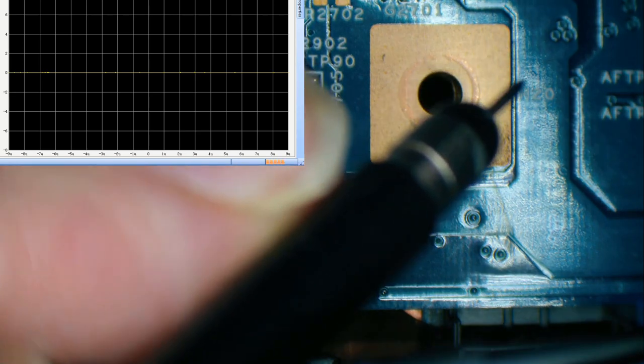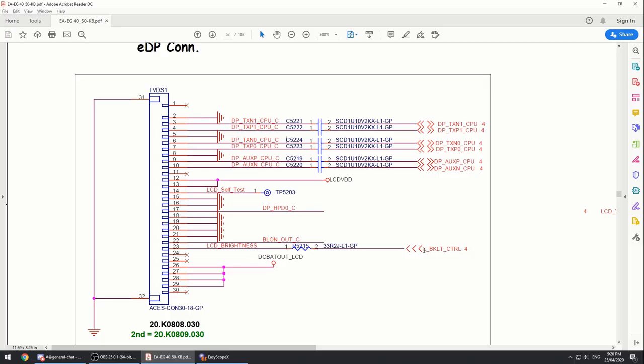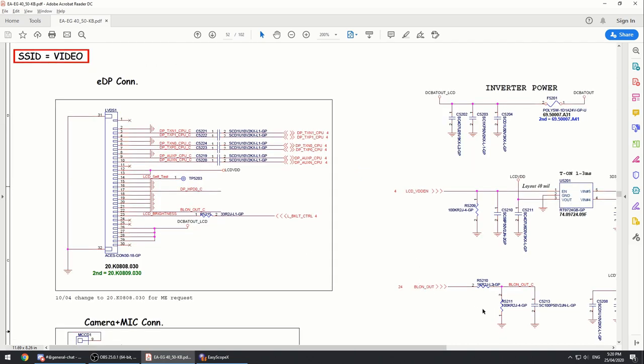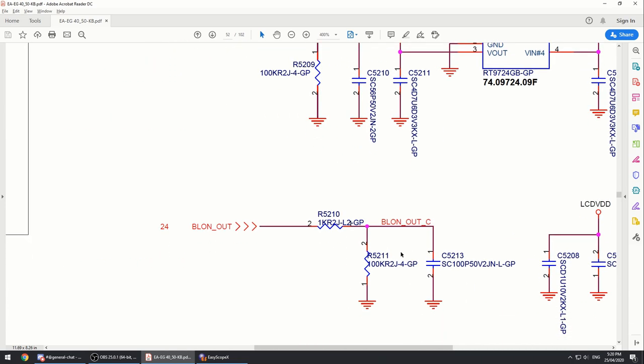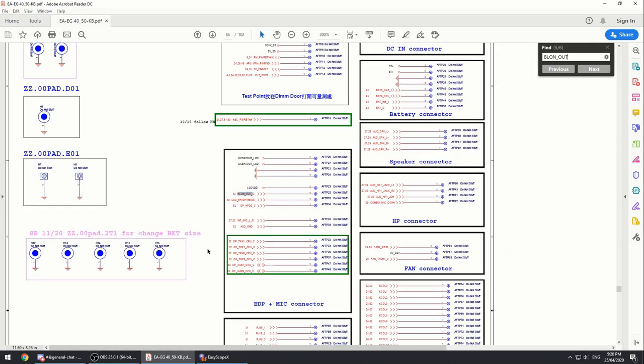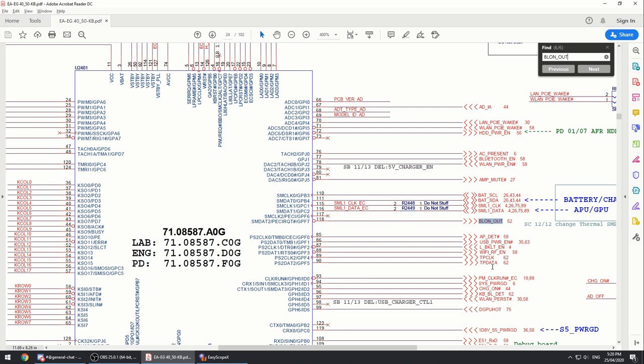The signal goes to the PCH or something similar. If that doesn't see the signal at the other end it's not going to initiate the screen. Where is the screen driven from? Let's dive back to the schematic and find out where the backlight control signals come from. Following backlight on out - that goes to whatever this chip is. This chip looks like possibly our system management controller.